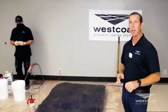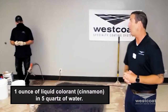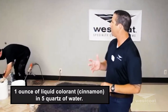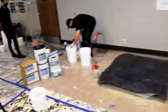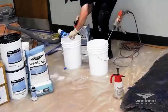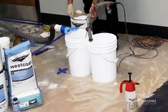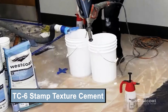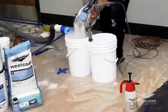For a 50-pound bag of TC6, put the water in the bucket first — four to five quarts — then add liquid colorant. We're using cinnamon color, one ounce, in five quarts of water. You can see he's got a little pump-up sprayer to mist out that medicine cup with color. Mike is now mixing the 50-pound bag of TC6 cement using the same cage bit mixer.